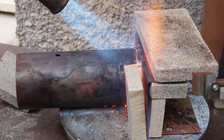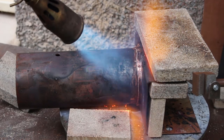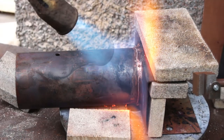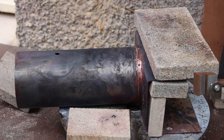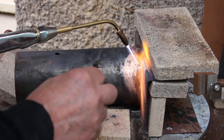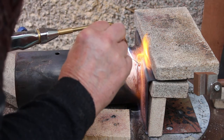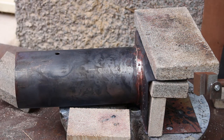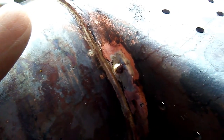I'm going to try and use the oxypropane torch to silver solder in a new rivet. First I'm using a propane torch to get some background heat, because the oxypropane torch on its own won't provide enough heat — the copper soaks away the heat too quickly. The silver soldering of that rivet in that location seems to have gone okay.